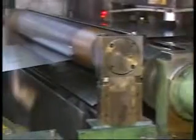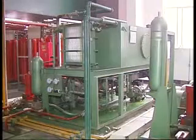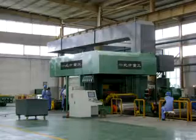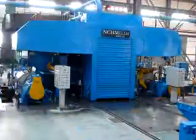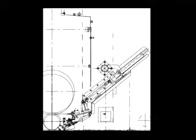The entry guide roll bearings are lubricated with rolling oil, and the exit guide roll and iron roll bearings are lubricated by grease. The general hydraulic system uses rolling oil, which not only lubricates the bearings but also prevents leakage of medium from polluting the rolling oil.